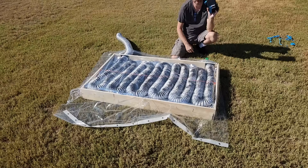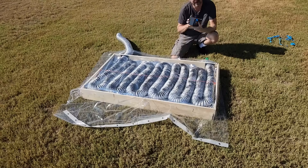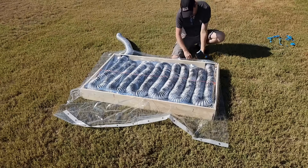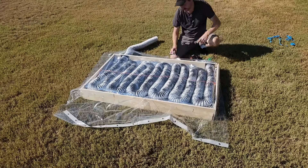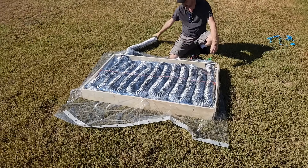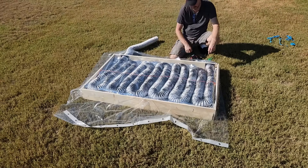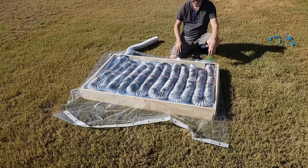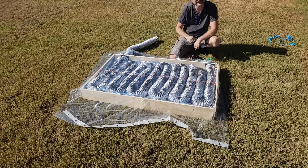For the test I'm using this little 12-volt, 12-amp-hour lithium-ion battery. You could easily run this thing on solar. Immediately, the air temperature on the intake side is dropping — we went from 104 down to 100 — and the output temperature is climbing rapidly: 96, 98, 100 degrees and climbing. They're going to stabilize and then the system will kick in. We'll come back in 30 minutes or so and see what happens. This is about 11 o'clock.